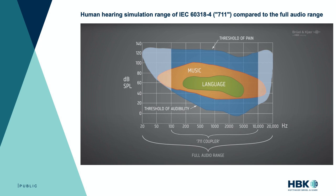But there are some key limitations with the 7-11 standard. While they are routinely used to measure headphones from 20 Hz to 20 kHz — which is generally accepted as the human hearing range — 7-11 simulators are only specified to simulate human hearing from 100 Hz to 10 kHz. Below 100 Hz and above 10 kHz, you can use a 7-11 simulator as an acoustic coupler, but it is not simulating human response in those ranges. This limited range was more than adequate 40 years ago when the focus was often things like hearing aids and telecom devices, but high-resolution devices in the decades since routinely cover and often exceed the range of human hearing. So to get the full measure of the more advanced devices of today, we need to model human hearing across its full range.